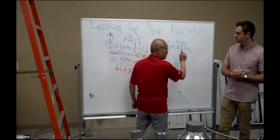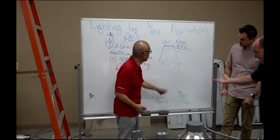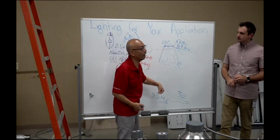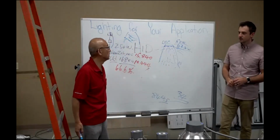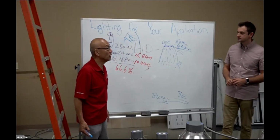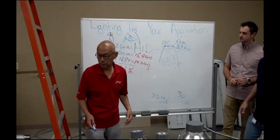Yeah. So potentially, Paul, with that kind of foot candles on the floor, that's a lot of foot candles. You may not need a 50 watt. You may only need a 40 watt, that's it. You know what I mean? If you're talking about 40 watt, that's a lot of wattage savings.